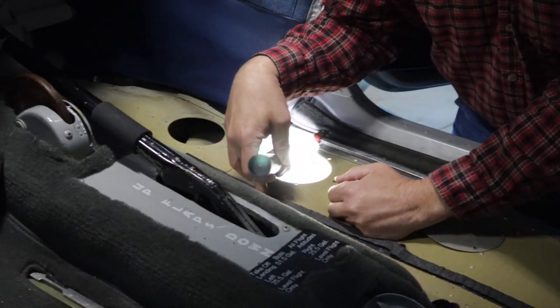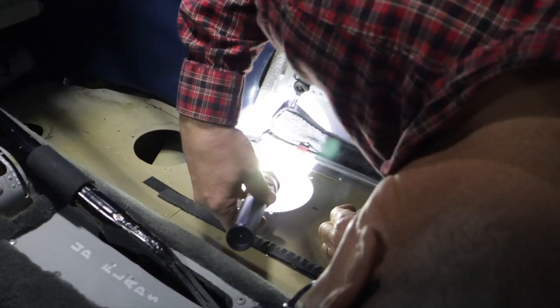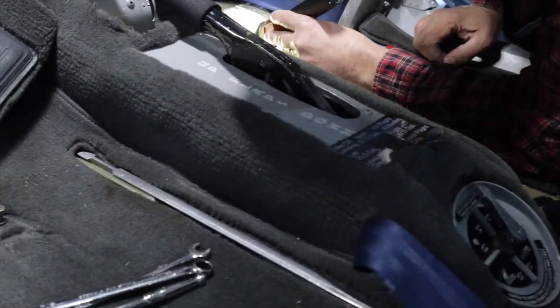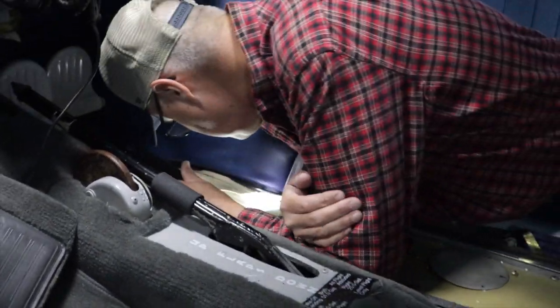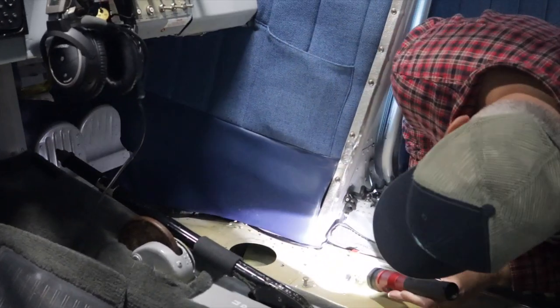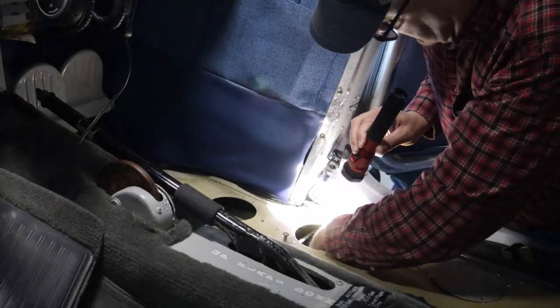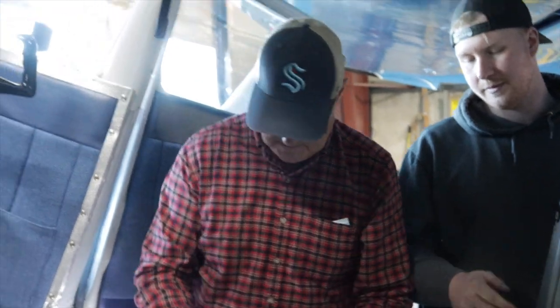What don't you like on this one? I'm just saying the 170 period — the engineering's flawed, and that stringer ends up taking all the load and it can't. So you didn't see one particularly wrong on this one? Well, it's just got the damage they all have. It's got that indentation outside the gearbox — your gearbox tries to tweak back and the cabin stays. You've got like a quarter inch of steel going into 32-thousandths. That curve isn't supposed to be there.